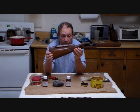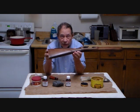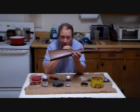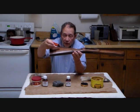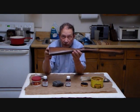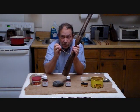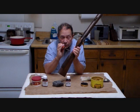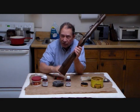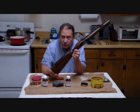Place your cheek right here — now it shoots to the point of aim. At present, we are about to complete the finishing of the stock. Now, there are a few cosmetic things that make a difference. You'll notice here there's a light line, which is the glue bond. We want to cover that up. There's also a light line on this part of the stock — it's been sanded a little more than the rest, and it's a little lighter looking than the rest of the stock. These are things we can fix.